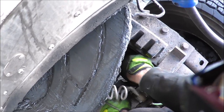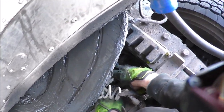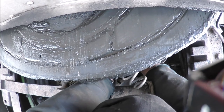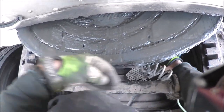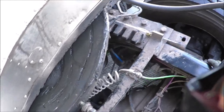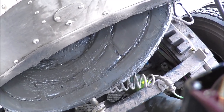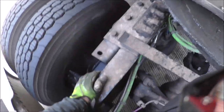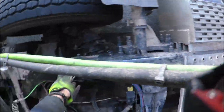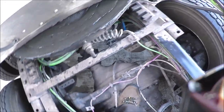You have a suspension airbag gauge and a lot of them use it for the weight to see if you're overweight on your drives — that's 34,000 pounds, usually about 50 PSI, and the Peterbilt was up to 60. The main thing is connecting this back up again and getting on the road. At least you're not damaging the equipment — bring it home safely so you can work on it in the yard; it's a lot cheaper. Now this axle and U-joint back here is not going to be in a bind. You really start hurting things when you twist off the U-joints and the drive shafts are on the ground. Especially the front U-joint — if that goes out it moves to the side and really starts causing damage.